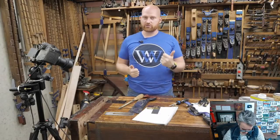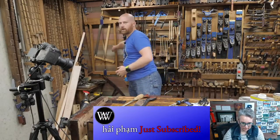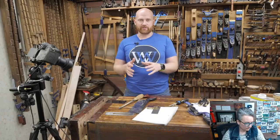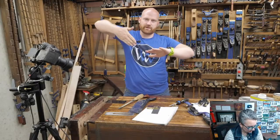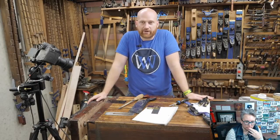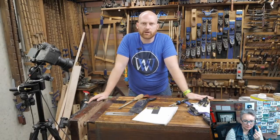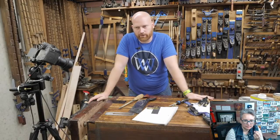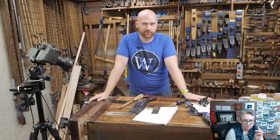The best patterns that I usually use come from Blackburn Toolworks. He's the same guy who makes my frame saw kits. He has a crazy resource on there. He has saw handles, and you can actually measure your hand and get the pattern that fits your hand. It comes in different sizes, all the way from the dovetail saw down to the frame saws and hand saws. So for patterns, that's what I would get. As to the blade, just get simple spring steel. Don't worry too much about the best steel on that. It doesn't really matter that much. You'll want thinner plate for your smaller saws and thicker plate for your bigger saws. So I hope that answers your question. If not, clarify and I will answer further.